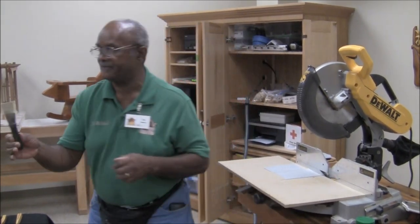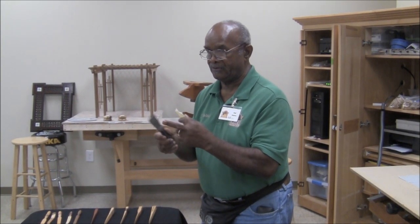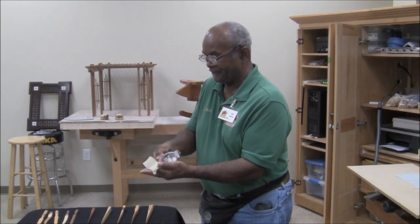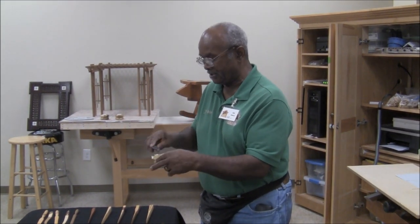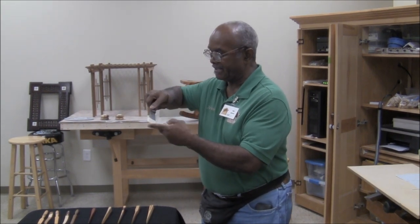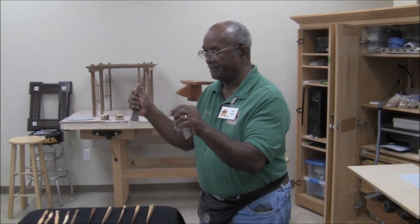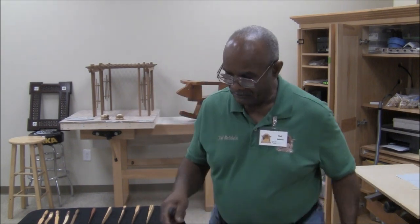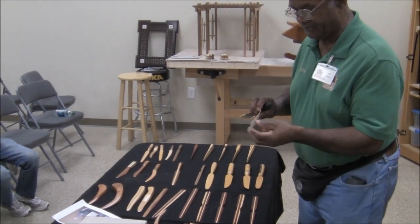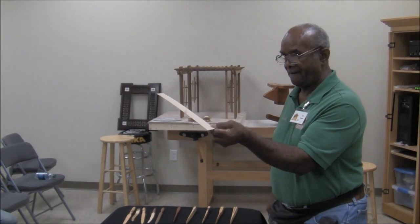That's why I have this putty knife, and I keep tape on it because it's sharp, and it will cut you. So don't ask me how I know that, but I put it on my belt sander every now and then just to keep the point sharp. But it allows me, when I stick stuff together with two sides of tape, to get between two pieces without marring either piece of wood. And I can get them apart, especially when I want to rip something thin. I can run, even thinner than that, I can run this through my planer or jointer when I need a thin piece, safely.